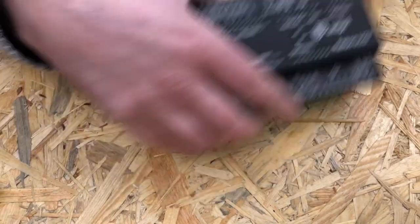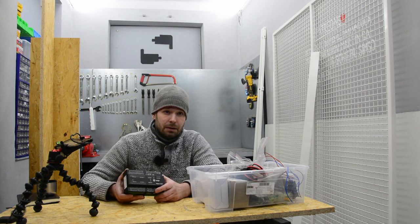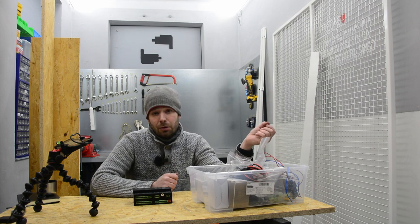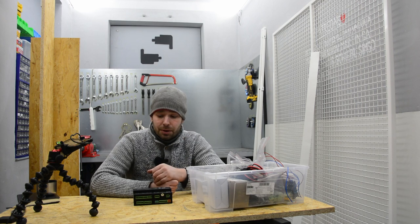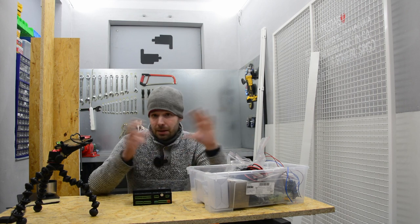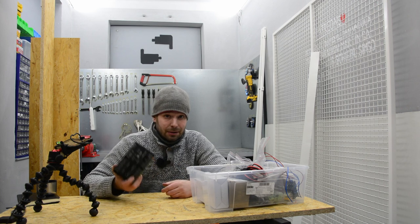So I will be using a Node-RED programming interface, and it's mostly programming with a graphic interface. It looks like this. There are boxes which do some logic, and you connect them with a line. So when the digital input is, for example, activated, it sends a message to the connected blocks, and they decide what to do, and you can connect them in any way you like. So that's a very speedy introduction into this system, and I can talk about this for hours.